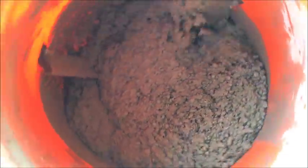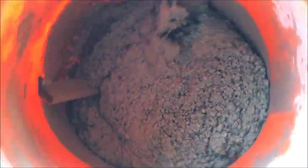That's three bags of 60-pound concrete and about seven and a half liters of water. It looks like the mix is pretty good, so I'm going to go ahead and dump it and then show you how to do the aggregate.